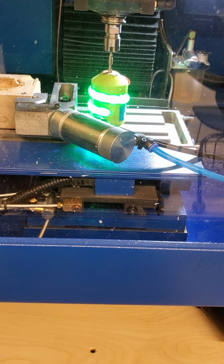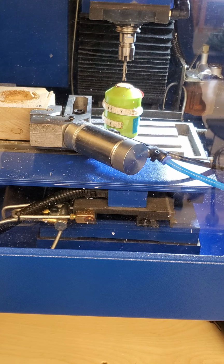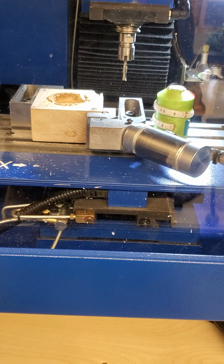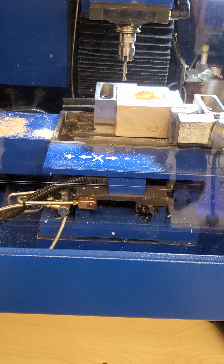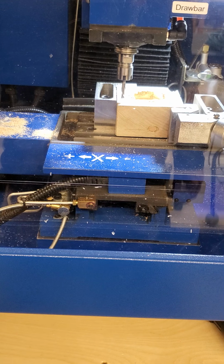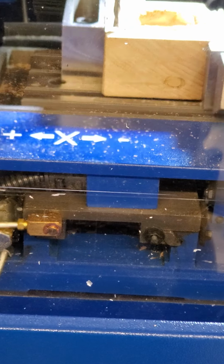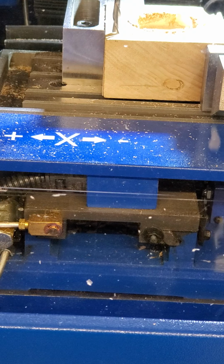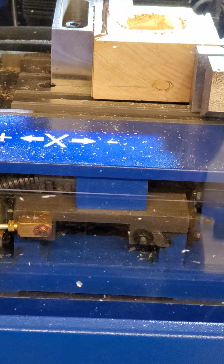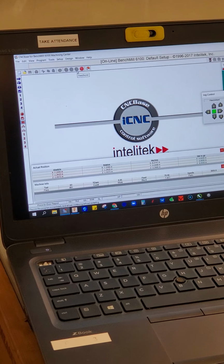What I've got to do now is come back over here and activate my hand wheel, and I'm gonna go and drive this machine to my actual part that's in there. And again, for the purpose of the demonstration, I'm not gonna go crazy with getting this right on there. That looks okay to me. Pretty much no shadow for the demo, we're all right. So what I'll do now is I'll call that my part. I'll call that 0 on my part.